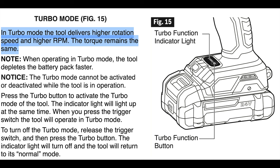As you may have noticed, on the 2.5 amp hour battery, it cut out after run one of the half inch lag test. The 5 amp hour battery cut out between the 5/16 inch and the half inch. And with the 8 amp hour battery, it cut out right after the second 5/16 inch lag test, right? So that's something to point out.